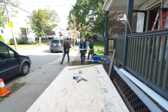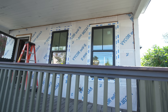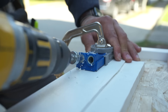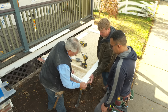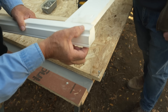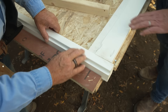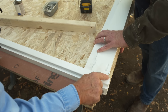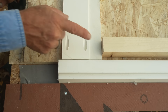We got all our pieces cut. It's always nice to have a jig when you're putting pieces together, and we've got a lot of windows to put together. I like your jig here, Tommy — it makes life a lot easier. You've got a screw here to keep the side casing set off from the end of the sill, and it's nice and flush in the back. We put a spacer to keep it down the thickness of the sill, and a stop here so it will hold when we screw against it.